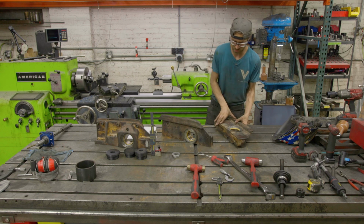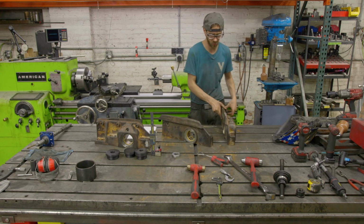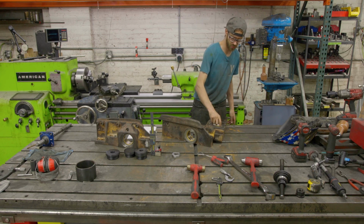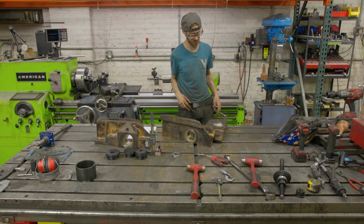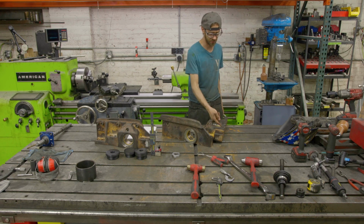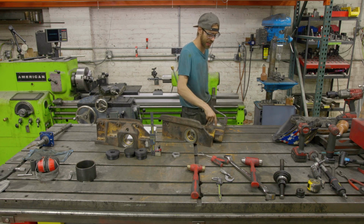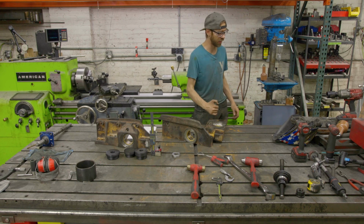But on the back side, as you can imagine, it was really tight on my bearing housing, and it wasn't until the last one where I realized I had enough room to sneak my cutter in and step face the back. So on 2 out of the 3 of these, I basically had to grind inside of this pocket to level out all my weld runoffs. And then once that was ground, I threw another pass and ground that down. Just because you're in a hole here, it's a pain to grind down there.